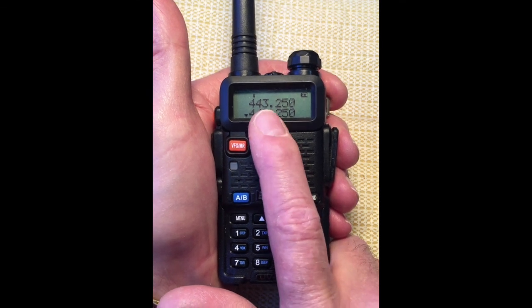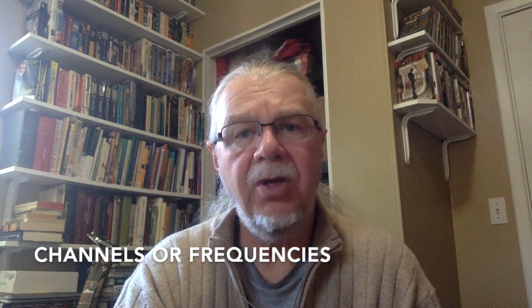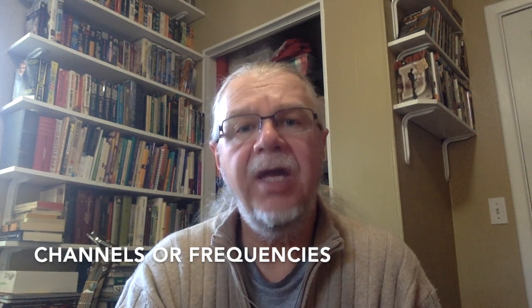With Transmit Dual Receive mode enabled, the radio will monitor these two channels. Any active transmission on either channel will be heard — the green LED will light, and a flashing triangle will indicate which channel is active. Remember, only the active frequency or channel is able to transmit. Dual watch mode allows us to monitor both the A and B frequency or channel, but the A/B button determines which of the two is able to transmit. The display line marked with a small triangle is available for transmission.